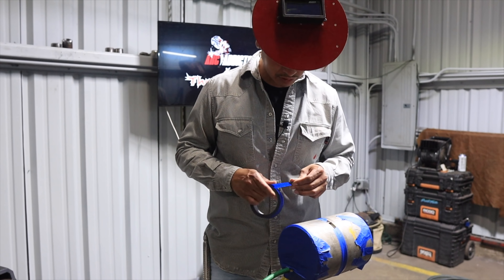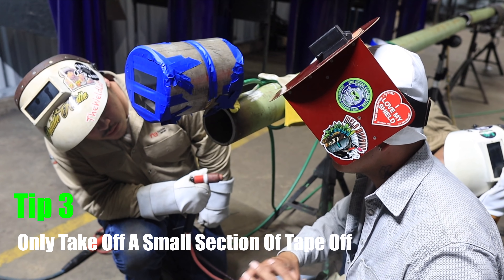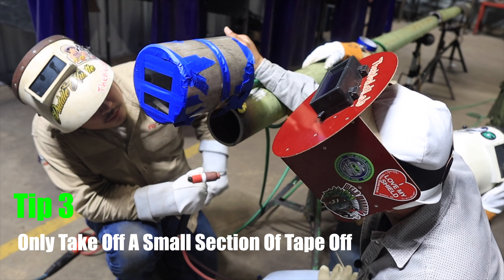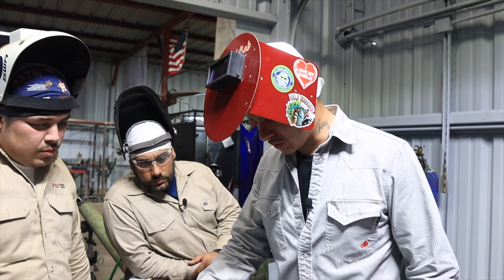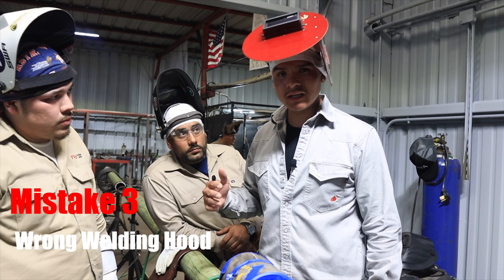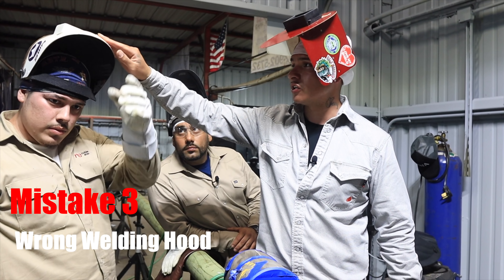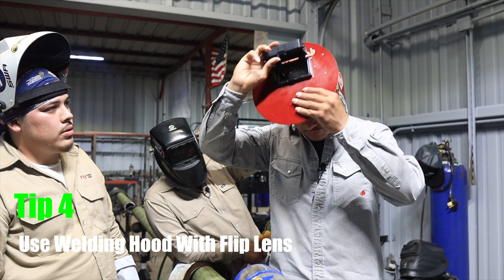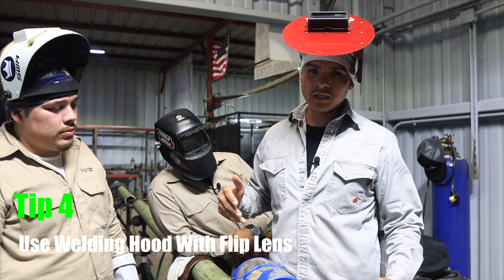Whenever you do stainless, just take off as much tape as how far you think you're gonna travel — about two inches. Don't take off too much or the argon will come out. So he just ground the bridge tack and I noticed one thing — he was grinding without a flip lens, and that could really hurt you. It's a nice hood and it looks good, but if you get a tiger hood you need to have the flip lens. Same with a pancake — have that flip lens, because you can easily get something in your eye.